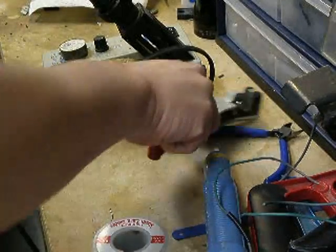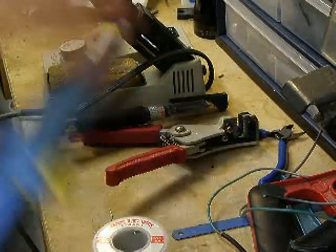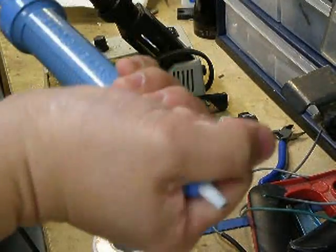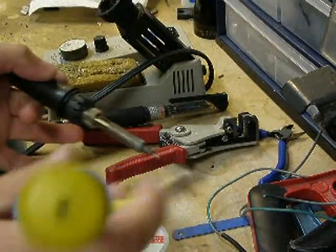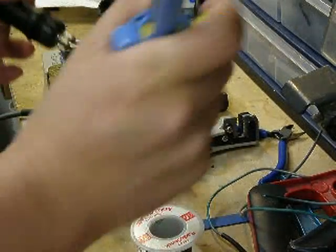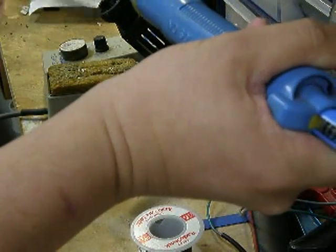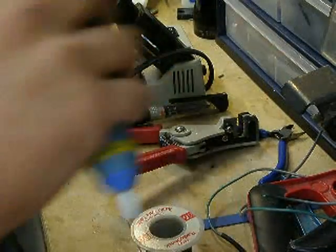The other thing I have here is sometimes if you're working on circuit boards, you have a solder sucker. Basically, you want to put the soldering iron onto a metal contact or where the component is, and once everything is melted, put this over the component and it will suck up the melted solder. So this is a solder sucker.